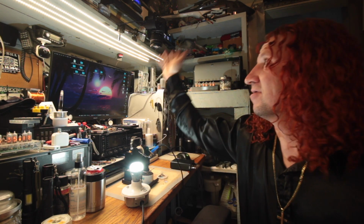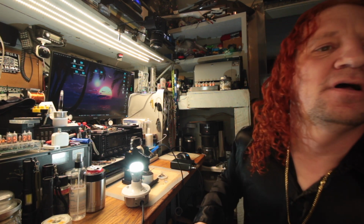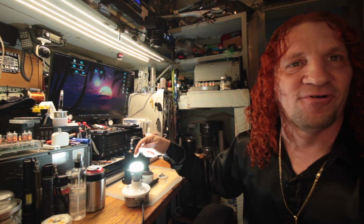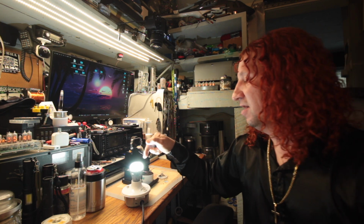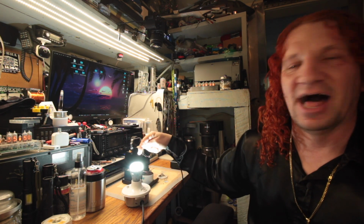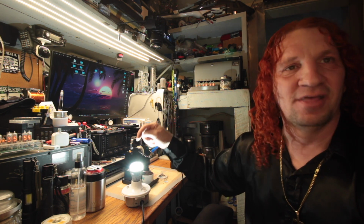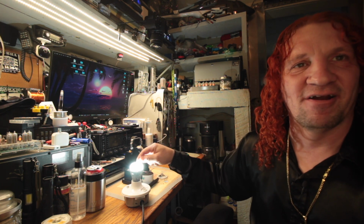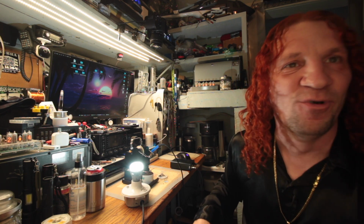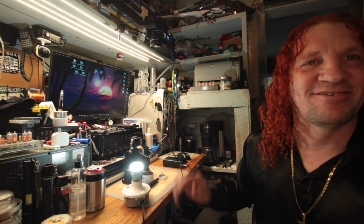So what I did, and of course the overhead camera wasn't working, it's not working for whatever reason. I'll fix it later if I do, or just get another camera, because it is what it is. But anyway, luckily the circuit board was the jump connection for my particular area. You see the wires going up the backside, so it goes to that junction block in there, and then the junction block is connected to the trace in the substrate. So I went from the junction block and put the wire on there, because you can see where the wire connects up and over. I connected over to the next LED and was able to jump it successfully. Of course, as soon as I moved it, I broke it off, but was able to reattach it again and get it to work. So it lost a couple of watts, so it's a little bit more efficient now.